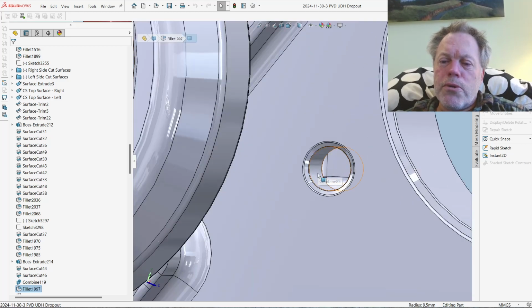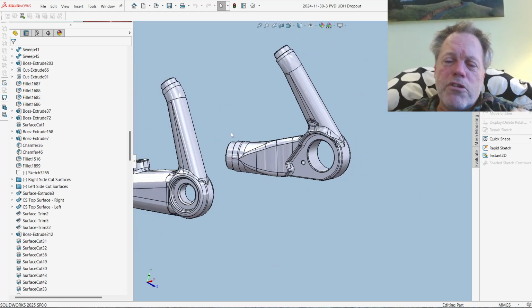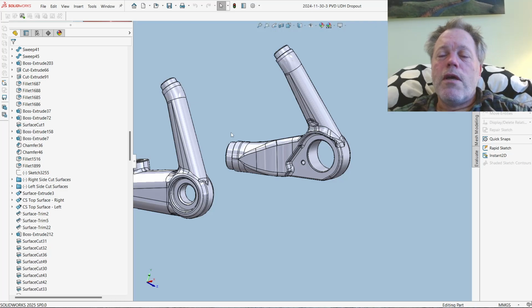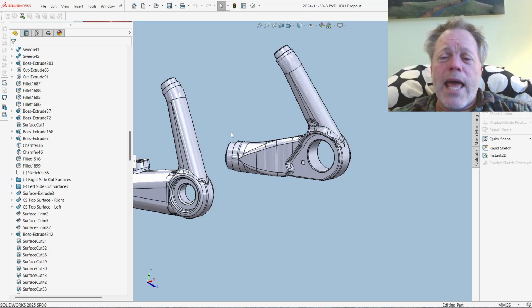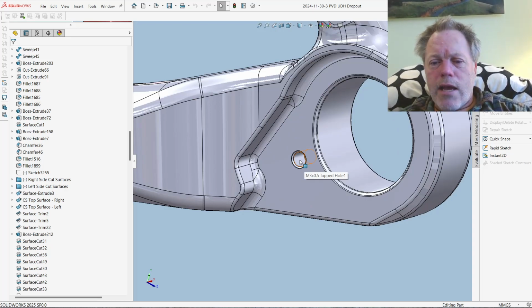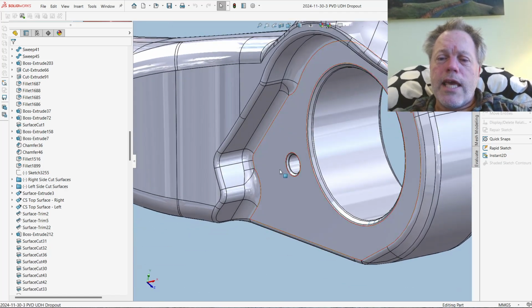This is our bleed screw. There's a set screw that goes in here. If you noticed, we're having a problem with 3D prints being permeable. This isn't just a problem for low-cost bike producer types like me, but even in high-tech type companies or fancy customers, gas permeability through prints is a thing. I show it in the M2F2 paint problem I had, where gas was permeating through a sealed section through the 3D print while it was in the powder coat oven. So now the whole rear end has a bleed through this hole that gets covered with either the UDH hanger or the T-type derailleur, and then I screw in and seal a set screw after. So that's hidden from view right there.